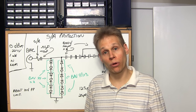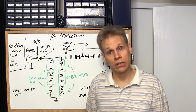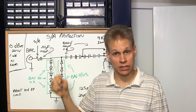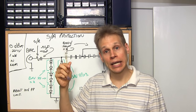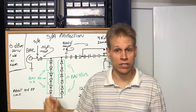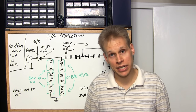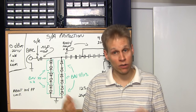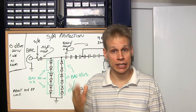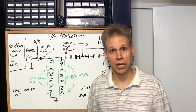If you over-couple onto the grid cap of the mixer tube, or over-couple to the last IF transformer output when adjusting the slug or the variable capacitor — like on the DeForest Crosley — the stray capacitance imposed by your test lead, and also the stray inductance of that lead, will affect your response pattern. Remember, one to two picofarad of coupling seems to work very well with the 3585B spectrum analyzer.